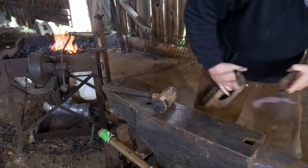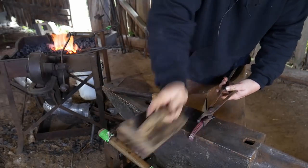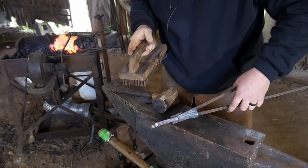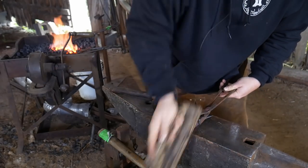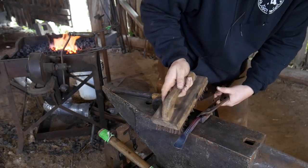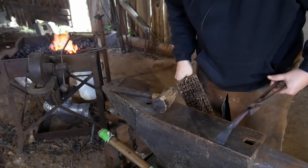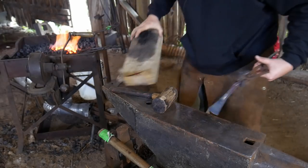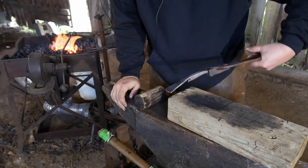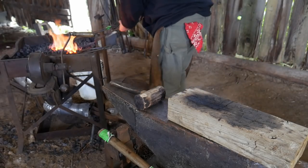We don't want to lose the squareness of this piece — we have it all perfectly filed square. Be very careful with your tong placement at this point, because if you place the tongs on your decorative parts that you've filed and chased in, or you hammer this on an edge of an anvil where it's not supposed to be, you can end up creating dents and dings, and that's not going to be good for the final result. Now the next part won't take as long. We are going to get this portion heated up — that'll be the fishtail scroll that's in reverse.